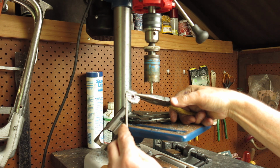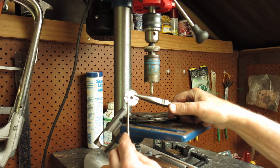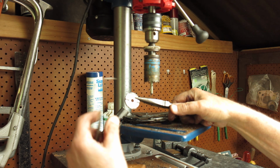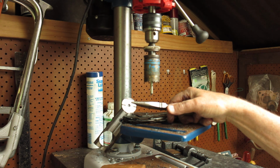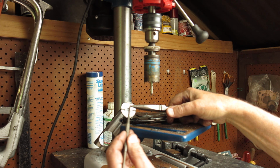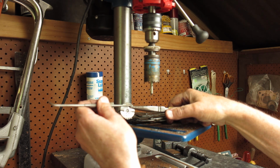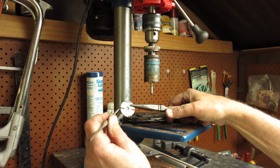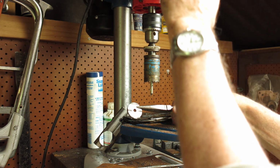We've got the tangs here for engaging the retaining ring, and I'm now going to mill off this piece and this piece to leave this narrower. We don't need it full width, and it allows me to use it in a 35mm camera to easily get it through the film gate if this is narrowed down. We're only interested in the full length from here to here, and I'll better measure that and see what we've actually got.